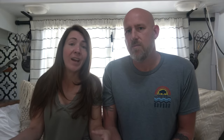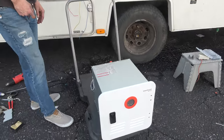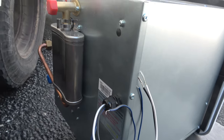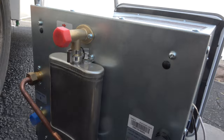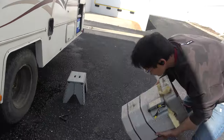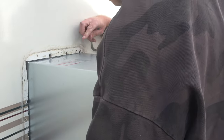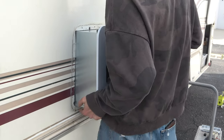The next great thing about instant water heaters is that they are smaller and lighter weight. Because they don't have a holding tank, you're saving about 50 pounds by not carrying that extra water. They don't take up as much space because there's no tank holding 6, 10, or 12 gallons of water — not only the weight at 8 pounds per gallon, but also the size. It still fits in the same hole your old water heater came out of, but you get more room because there's no big tank. In RV life, space comes at a premium, so wherever you can save weight and space, it's a bonus.